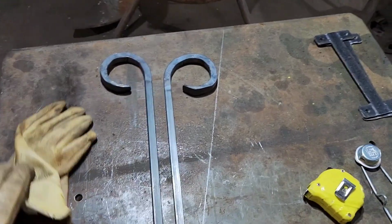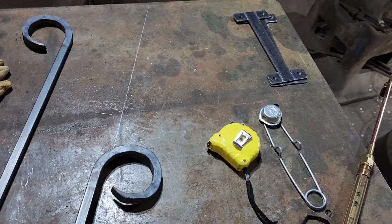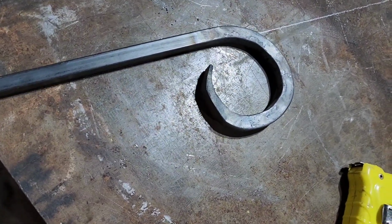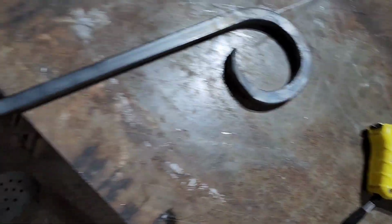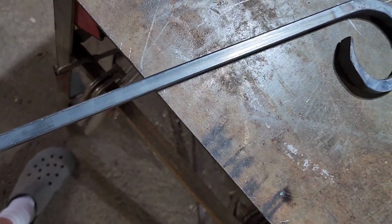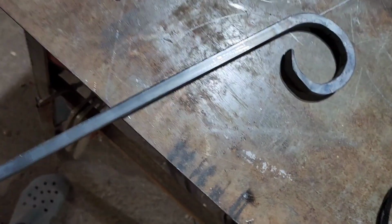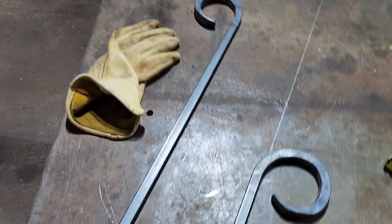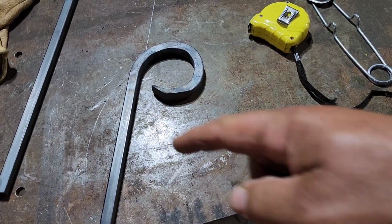Got our 2 hooks made. So basically what these are going to do is we'll cut them wherever we need them to be to get this thing to hang at 8 inches here. So about right there, and then we'll cut this angle on it as well. We'll just pencil that out and that'll be close enough, and we'll cut them with our 4.5 inch grinder, and we'll do the same to both pieces, and then we can concentrate on making our other piece that goes this way.